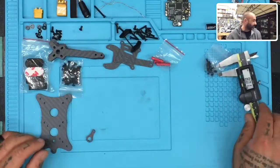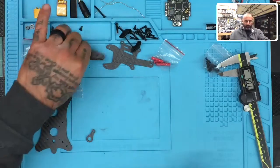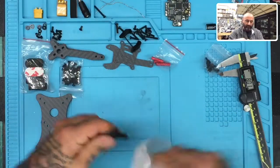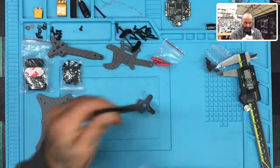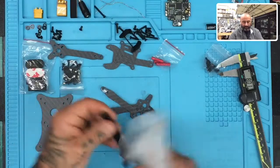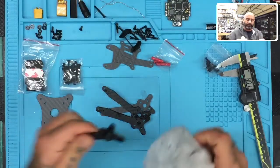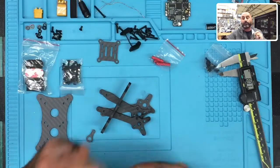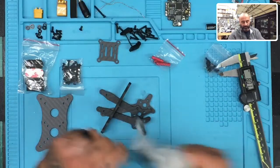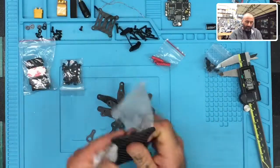You can see there's still some dirt here. I'm going to get some alcohol wipes and wipe this down. I've said this in other videos and I'll say it again: when you get a frame, I wash them first. I always think it's a good practice to just go ahead and wash it anyway — nice warm soap and water, put it in a bowl, move it around, get it cleaned off, then dry it. There's always a chance you'll get some carbon fiber dust on your hands if it hasn't been washed.